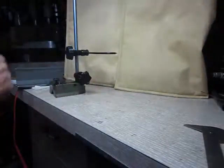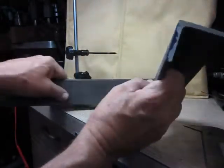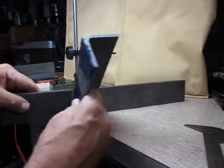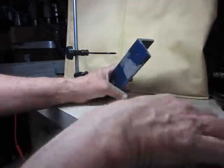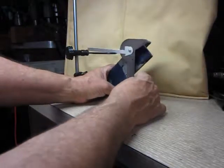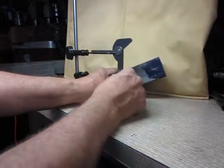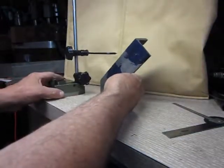This is the right-hand part, so it's better to show the left-hand part. This part is going to sit flat. Let me use your imagination — this is how it will look if it were welded on here. This is the left-hand side. This is marked in 64ths, so 4 inches plus 32/64ths — you can see the line of plumb here. Then I set the marking gauge using this to get it exactly to 32/64ths. I held it more securely when I did this, and then I scribed.